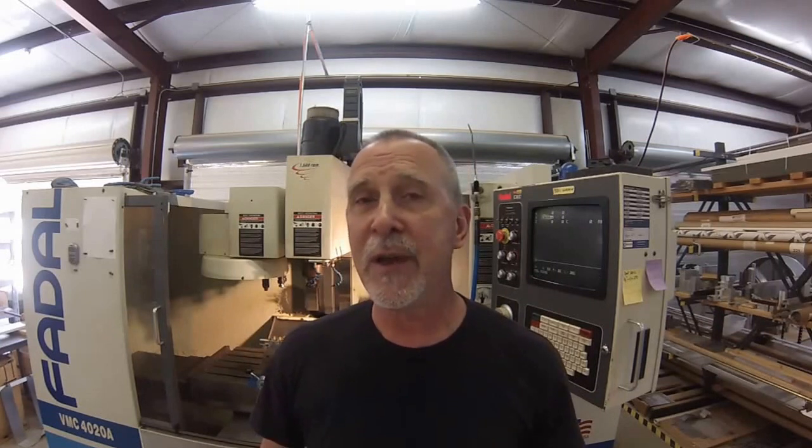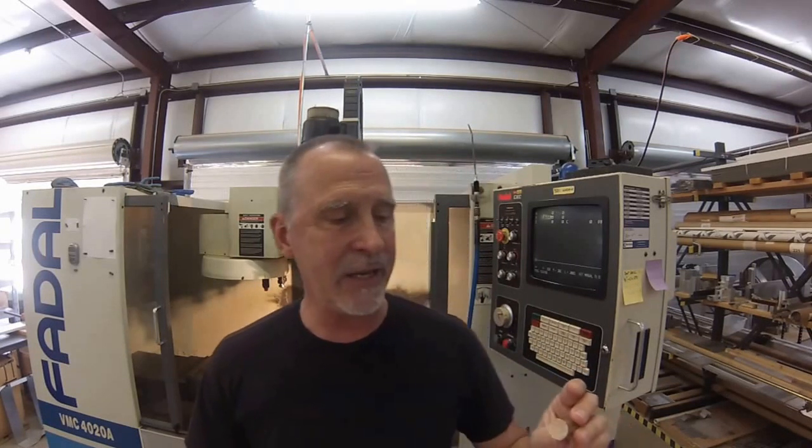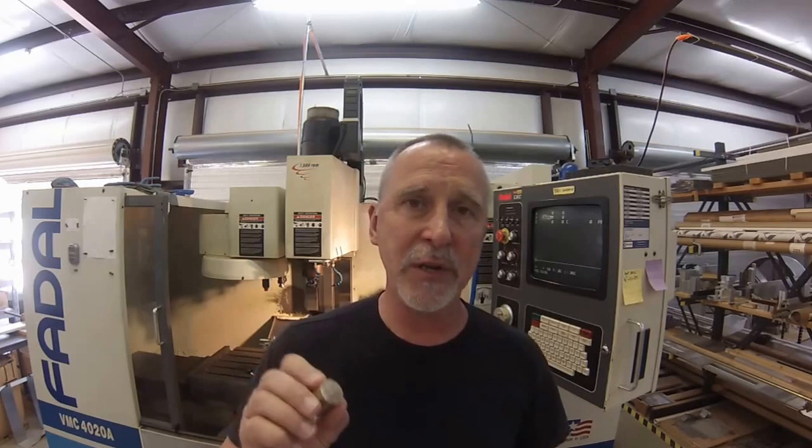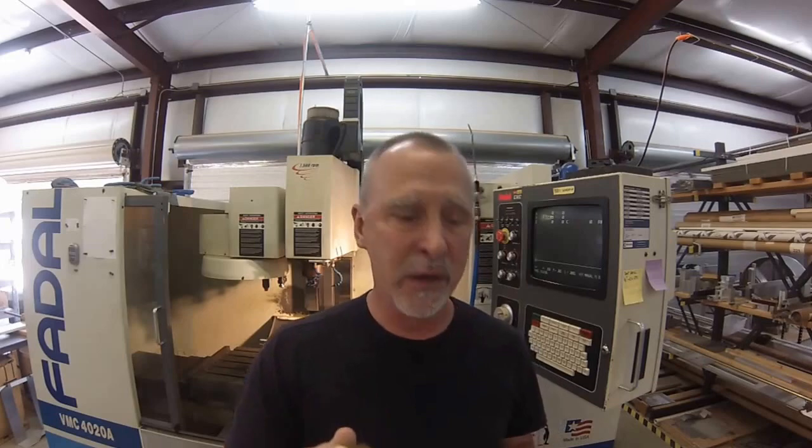If you're working for someone, it's like, 'I quoted this at this much time, got to get it out the door, no time to make the fixture' — but next time around there's going to be no time to make the fixture either. So this time around I decided to invest some time and make some tooling. If this little piece looks like it should be a lathe job, it absolutely should — except some of these parts have multiple holes in the end that are not concentric. When you get into that type of component, you need a very special CNC lathe with what's called live tooling, so you can put a bolt pattern or a non-concentric hole in the end of the part.